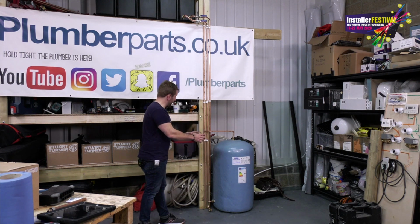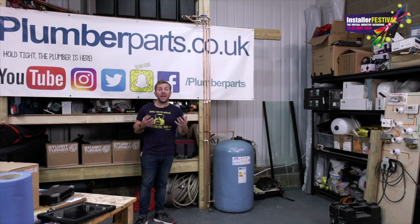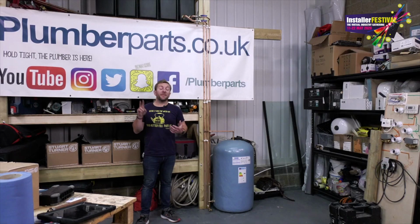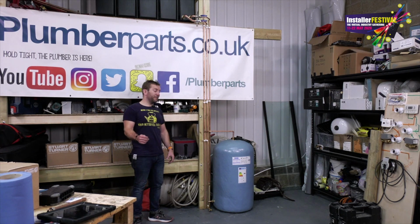We're going to put our shower valve in, we're going to pipe it up, and you're going to get a really good idea then about what head pressure is all about and why sometimes we need shower pumps to improve that, but also why some shower pumps don't work because there isn't enough head pressure. Because a lot of people go, oh, I've got a new shower pump, I fitted it, it doesn't work. But there's two little tricks you can do to a shower pump to make sure that it's a head pressure issue, okay? So I'm gonna get on with that, guys.